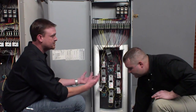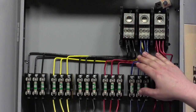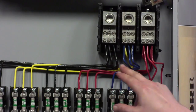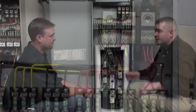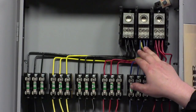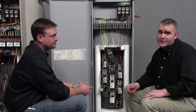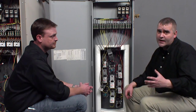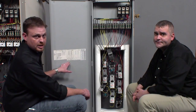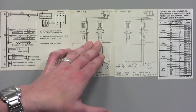What about the phase — what if you're going from three-phase to single-phase? This particular heater is set up for three-phase on this terminal block. All of the reds are going to be on the right terminal, blue and yellow on the center terminal, and blacks on the left terminal. But if you need to go single-phase, you would move all the blues over with the black and the reds over with the yellow. I will caution you — if they've already run their wiring and breaker size for three-phase, making that conversion could raise the amp draw, so they may have to change their wiring and breaker. The phase wiring diagram is on the label on the door — you've got three-phase and single-phase wiring shown right there.